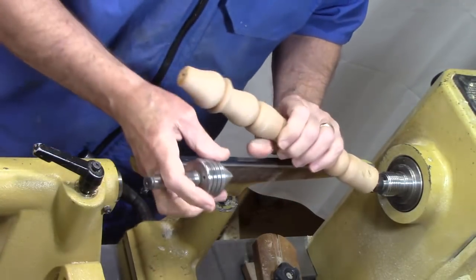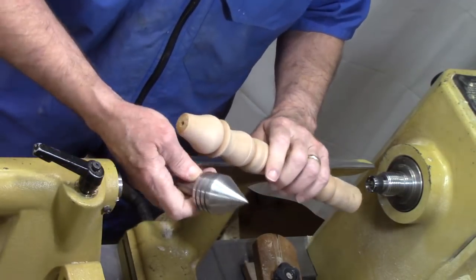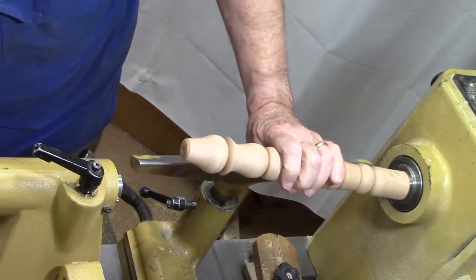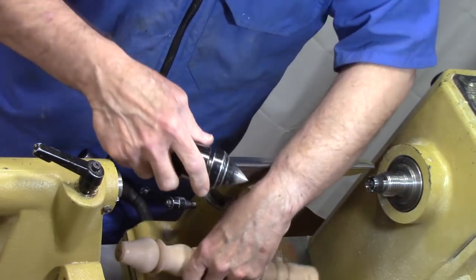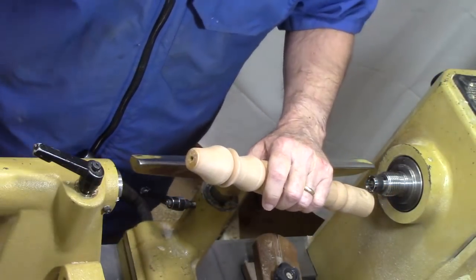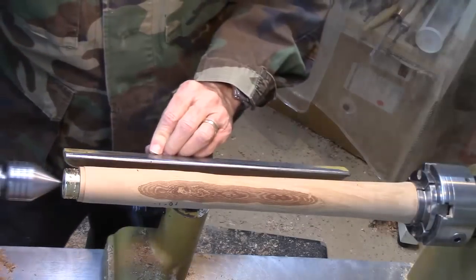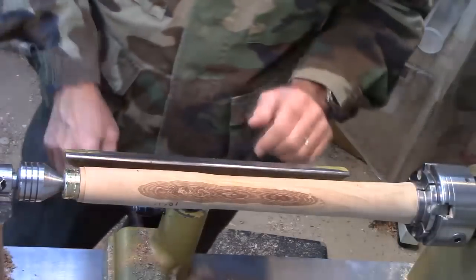This third-party cone center is about twenty dollars — an inexpensive Chinese one. If you've got a small lathe and want a cone center, these are not too terribly expensive. If you've got a full-size lathe like a big Jet or a Powermatic, chances are it came with a cone. I'll go into this in more detail in a moment. I'm going to go ahead and finish shaping this, using a 60-degree cone to support into the hole and give it nice support — I've got it in the chuck.